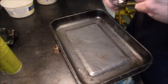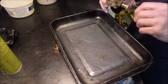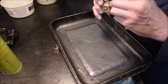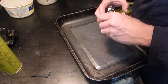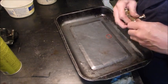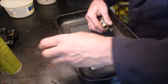Oh yes — the spring is even wider at one end. So we'll just tighten this up a little bit. This is our gate valve — it should go in there like that. I might even be able to replace that one. This has really been an interesting fix. It's multi sizes of wrenches. I'm tightening up the main tube back to the check valve. I still have to put this small ring in and then connect up the air.